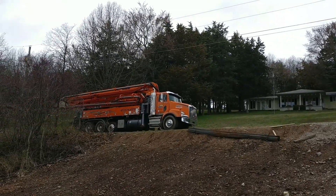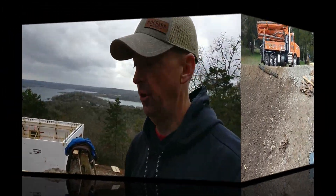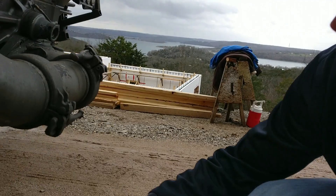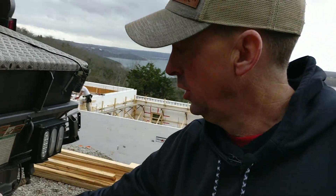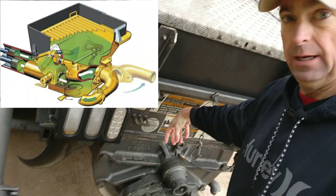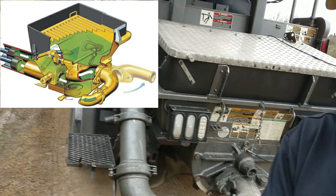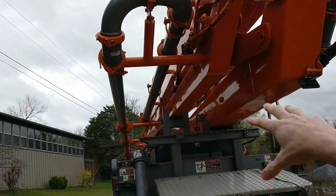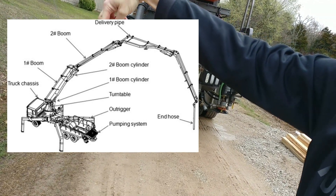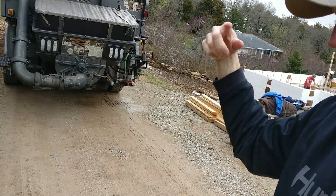There he is. We'll go up and I'll show you guys how a pump truck works. Pump trucks are very easy if you understand how they work. Underneath here is a huge pump — the concrete drops in right here, goes down, a big ram pushes it, and it comes out into the tubing, all the way up like a gigantic arm at the bottom. The operator has a remote control that can move the arm around and turn the pump on and off.